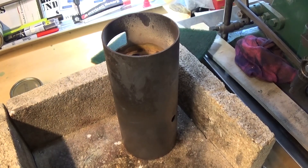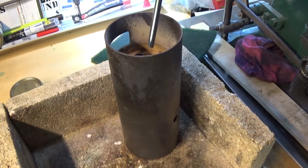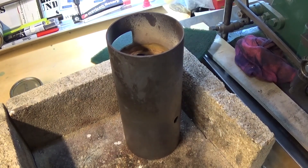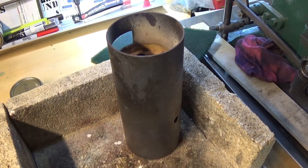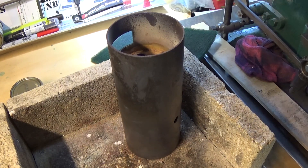There's a fair bit of work here. Because the camera is in the way and you need a bit of concentration, what I've done is silver soldered all the bottoms of the tubes and the bottom bush, which is the blow down valve. That's getting pretty hot — it is pretty hot. It really needs a bit of a pickle before I go any further just to see how it's looking. I'm going to let it cool down and put it in the pickle. There's a fair bit of heat there and I'm struggling to have enough to do the job, but it's getting pretty warm in here so I'm going to give it a miss for the rest of the day. I think we've got a pretty good seam around the bottom of all those tubes.